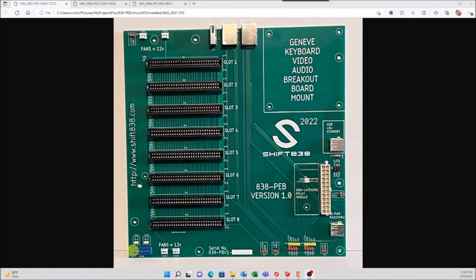Now over here, you will see this blue connector, which is for USB 3.0, or really what I have it used for is strictly your front USB ports on your PC case. Not just for power, but I also have these mapped into your data minus and data plus for USB 1 and USB 2. The reason I did this is for the micro GoTeks that have been released. I have purchased a couple, I've tested it with it, and it does work.